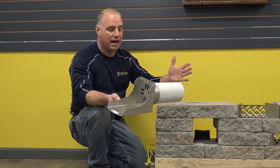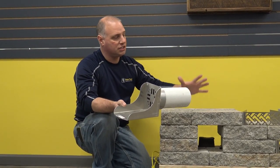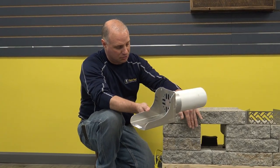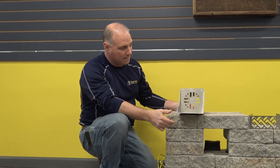A lot of contractors like to tie in downspouts, and obviously that's a no-no — putting water behind your wall into that system. But if you want to run separate piping and tie it into something like this, that will get your water out beyond the wall. You don't have to worry about it saturating the toe of your wall, which would lead to a job failure.